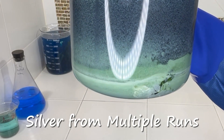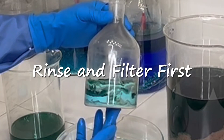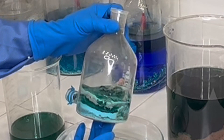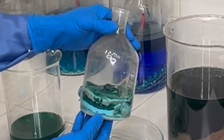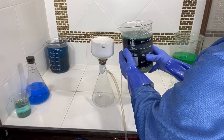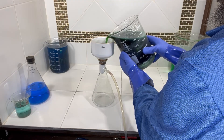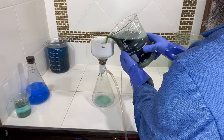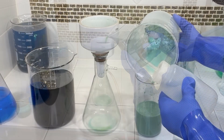There are two ways I know how to refine the silver from this point. One is you can go directly to nitric acid, but what I've found is the nitric acid doesn't completely dissolve all of the silver — quite a bit of it will get hung up, though it does work to recover the majority of your silver. What I've done instead is dissolve the contents of the aspirator bottle after filtering them in aqua regia. This will precipitate out all of your silver, and it can be filtered to give you fairly pure — if not three-nines pure — silver chloride.